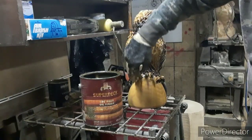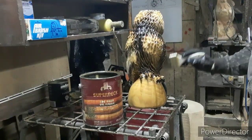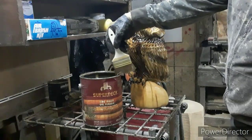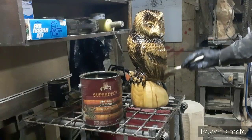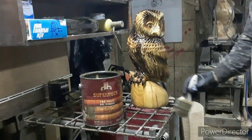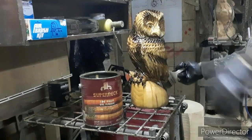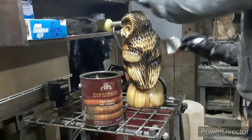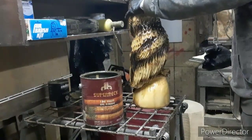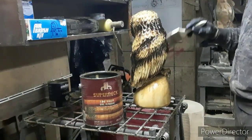If you could get a 50-gallon drum that you can seal off, and you want to get 5 or 10 gallons of varnish and oil mix in the bottom of that, and agitate it somehow, and seal it off. 5-gallon bucket, you could fill it with oil. For all these small pieces, you could actually oil them in a 5-gallon bucket, just dipping them. But that's a big expense. I mean, you're talking $50-$60 a can, plus your varnish. So if you go 5 gallons of oil, and then you take out 1 gallon of oil for your varnish, mix in a gallon of varnish. Now you have a 5-to-1 mix.